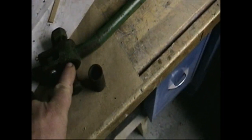This had probably about a 32nd of an inch play. This probably had a 16th. Down this end, we had another 16th of an inch of play. And up at the tip of the handle there, we probably added a foot of travel to the handle between all the places that had play in them. So hopefully we'll be able to take all the play out of the linkage so that the clutch handle has a lot less travel to it. And that's about where we are.